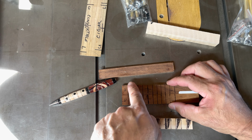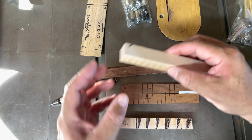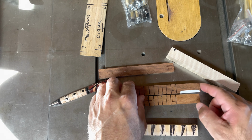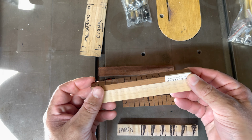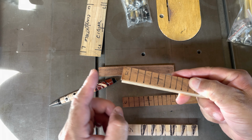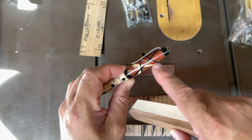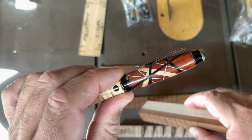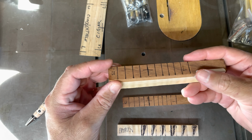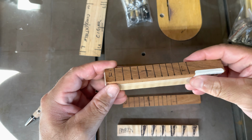I just need to cut these in pieces, put some aluminum between them, glue them back together. But first I need to rip this in half. And then I want to glue this to this, so when I cut this, these don't get lost and lose their shape. So I want them to retain that, so all the lines line up correctly, like over here. So I want these to line up so that the wood grain lines up evenly. After I cut this, I'll cut this off camera, glue it, and then we'll come back.